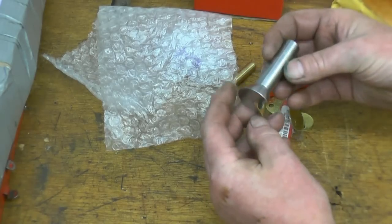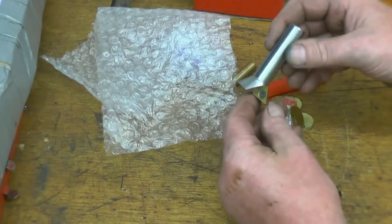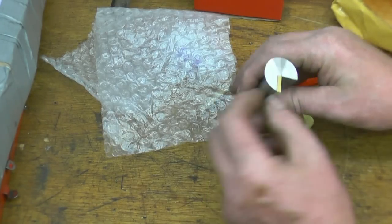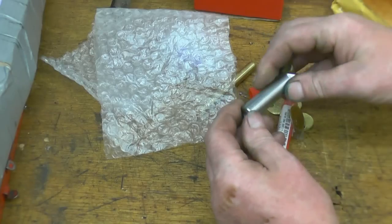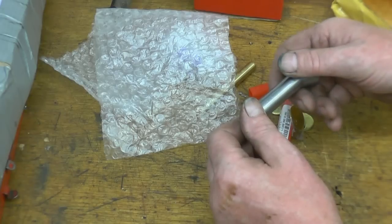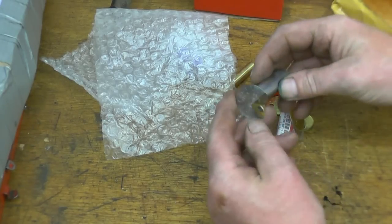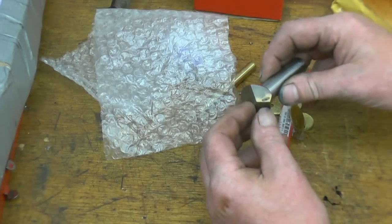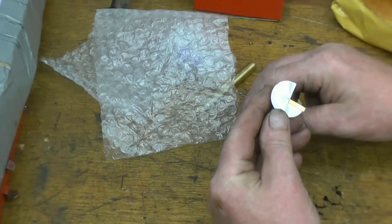Right, I've seen these before on the machining forums. It's a dovetail cutter, a homemade dovetail cutter using an insert. Once again, he's got his emblem on the bottom, Ronnie Richard in the shop. It's also got my name on, Double Boost John Mills. I've got to make some more tool holders for my lathe for the tool post, and this will be ideal for cutting the dovetails. I'll get some close-up shots of this and you can see how well made it actually is.